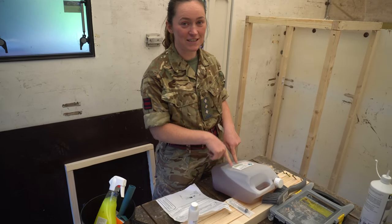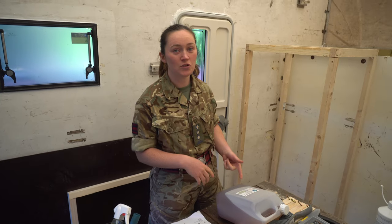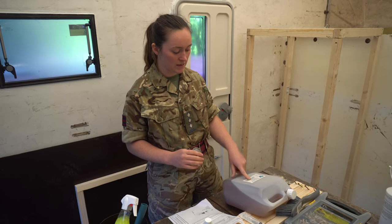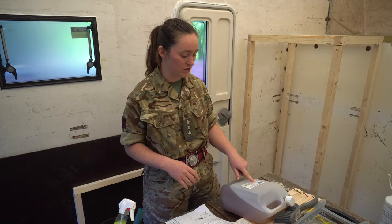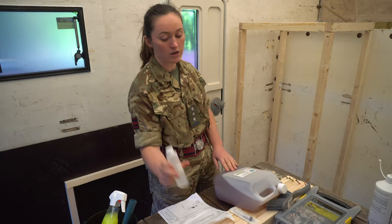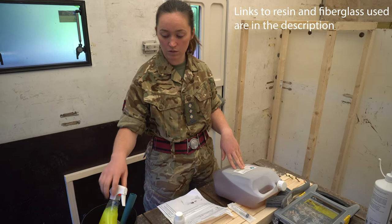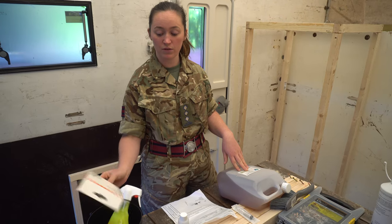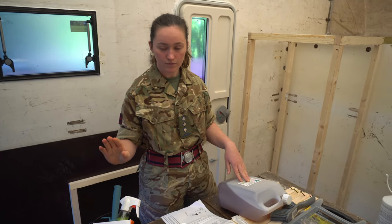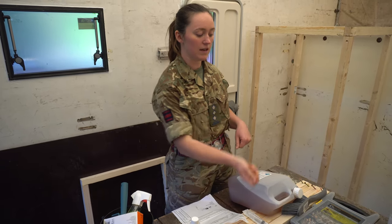This stuff — you can smell how toxic it is — so don't be getting this in your lungs. Don't get it on your hands or skin; it's not water soluble so if you get it on you and try to wash it off, you're scuppered. The ratio it says is two percent of the resin main body to the resin hardener, and they do give you a little syringe for that. When using this with fiberglass, you need to roll the fiberglass out. We've got a wallpaper brush because it was cheap — we'll throw it away afterwards. Use this to paint on the resin, then we've got a fiberglass rolling kit to get all the air bubbles out.